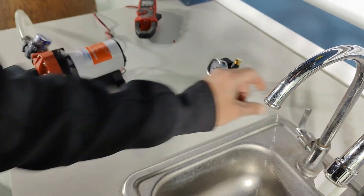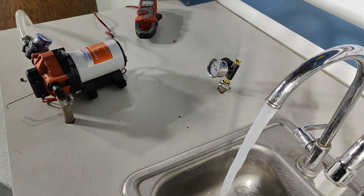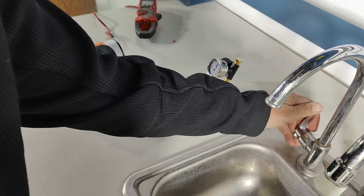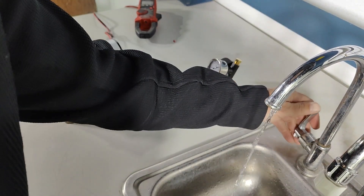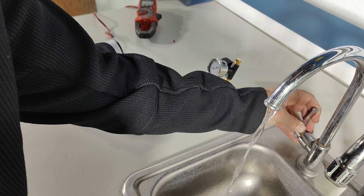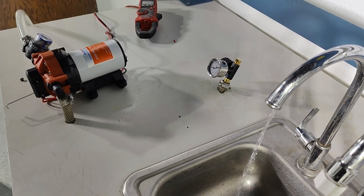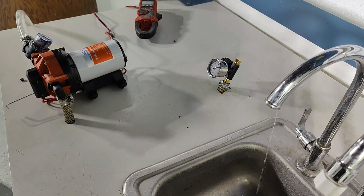Stop the pump, start the pump, stop the pump. As long as the pump stops easily we're good. Check for cycling — perfect, no cycling at any range of flow here. And no problem: when you shut off the faucet the pump stops. That's a perfect adjustment of the bypass valve.